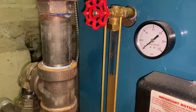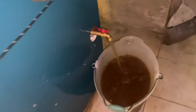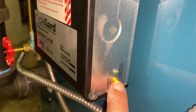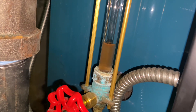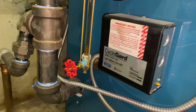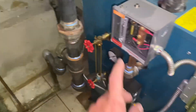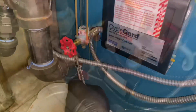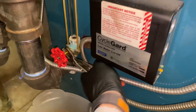We're on bucket number four — granted, not a full five-gallon bucket. I've verified that my low water cutoff is functional because I have the low water light indicator, and the sight glass is almost empty. I'm going to grab my tool bag from the truck. We're going to take out the pigtail and check that it's clear. Then we'll start with this bottom gauge right here.